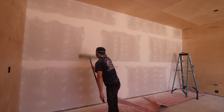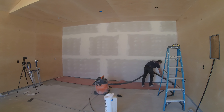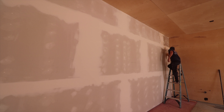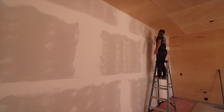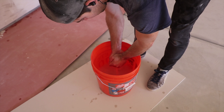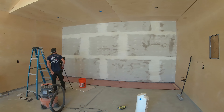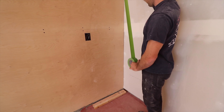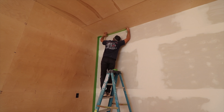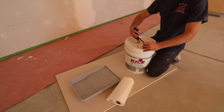This part is really dusty. I used a broom to pull the majority of lingering dust off the wall, then vacuumed it up. All the mudding was done, so now I could prep for paint. Even after brushing the wall there was still some dust, so before putting any paint on I wiped down the entire surface with a damp sponge, periodically cleaning it in a bucket. The damp sponge also softens any edges I may have missed during sanding. The last step before painting was to tape the edges — the plywood walls were already hung and that wood is going to stay unpainted, so I taped all the edges of the drywall, including the curb at the base.